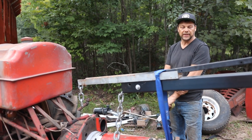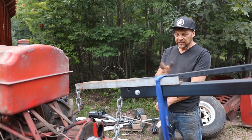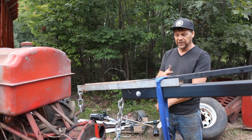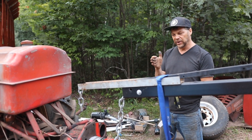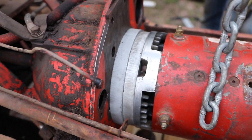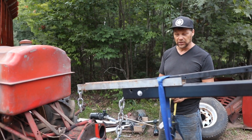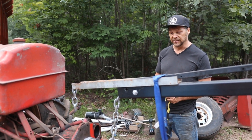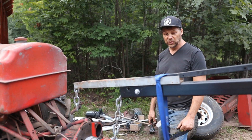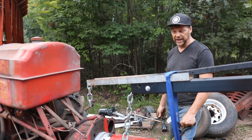It couples up like any electric vehicle — you simply mount the flywheel flex plate to a coupler on the electric motor shaft. This electric motor already had a coupler pressed on it; it looked like a lot of work to get it off and it was pretty close to what I wanted. So all I had to do was make an adapter spacer to get my clutch spacing right, and then it went into the bell housing just like any electric motor replacing a gas motor. A small aluminum coupling was all it took. As simple as that sounds, it required a significant amount of machining with tight tolerances so that when you start spinning the clutch it doesn't vibrate or cause unnecessary stress that could break something. It's really nice to have a lathe for this type of project, or a good friend with a lathe, to get things trued up accurately so it performs well.